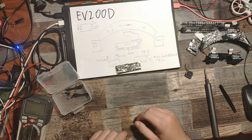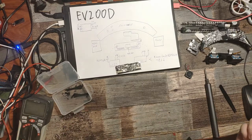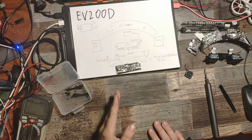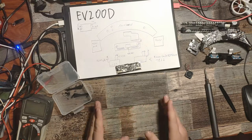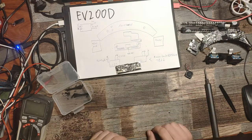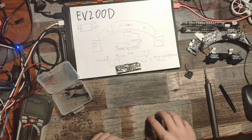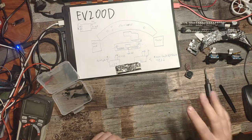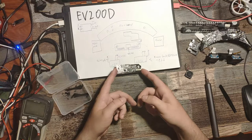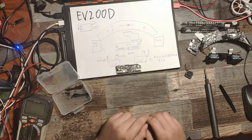So I desol­dered the fan and put it in the oven. After 20 minutes I let it cool down, tried it out, and everything worked fine again. I left the goggles on for like 55 minutes and everything was still fine — until I charged all my drone batteries and went out flying. It's quite cold out here, like 7 degrees, and after one pack, on the second pack it happened — the eyepiece started flickering again.